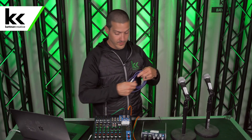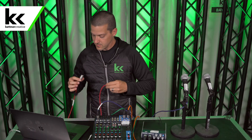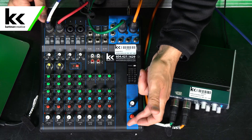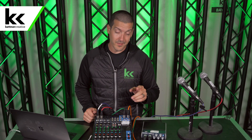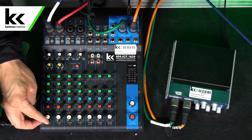Next we're going to connect two microphones to the audio mixer to show that we're getting stereo sound all the way to the computer. The first microphone we'll connect into input one on the audio mixer and the next microphone into input two. We're going to turn the stereo output all the way up to the triangle position, also known as zero or unity — there may be a zero or a U on your mixer, they all mean the same thing. We're also going to turn the level of the first microphone up to that same triangle or unity position.